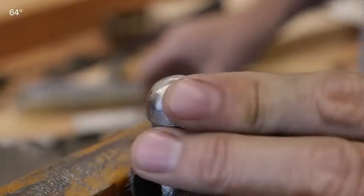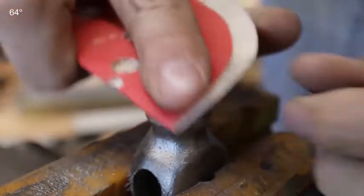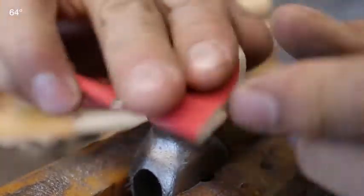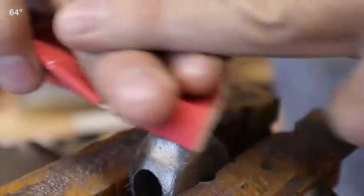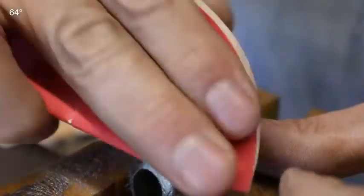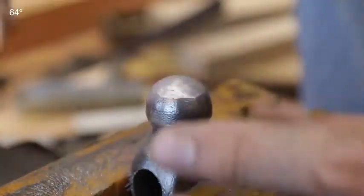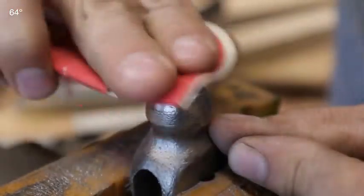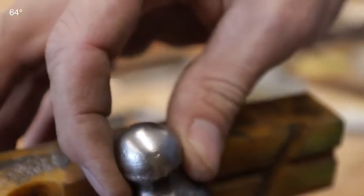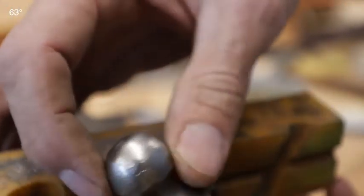Now there's going to be quite a few tool marks in there. To get rid of those, about 150-grit sandpaper or emery paper — even better. Don't put it on a block; you want it to be able to bend and form around the dome. Just go around in a circular pattern, and in about five minutes that will remove those tool marks, knock down the high spots, and give you a really nice, consistently even dome on the hammer that will look original. When you're done sanding, just take that back over to your wire brush on your grinder. And you can see that looks a lot better — nice and smooth and round, very consistent, much better.